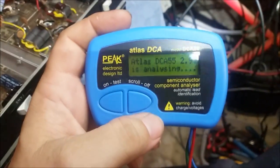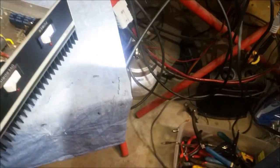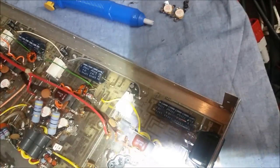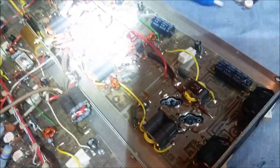I got the second one hooked up. See the same thing. But when I check on a diode meter, that's when I see there's a little bit of voltage from base to collector, and they're both identical. So they both got blown identically. And your bias resistor blew as well, which was kind of hard to see — it blew more up underneath. But I could tell once I got my headlamp and looked at it. I know those are the two resistors I sent you that you put on there. Probably going to put you a 3-watt 100-ohm right there.